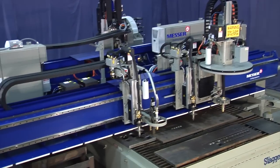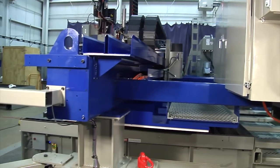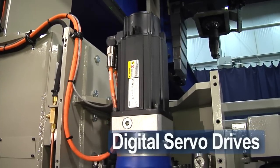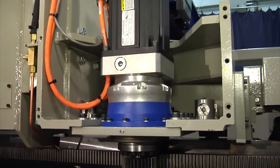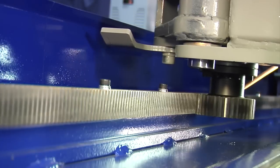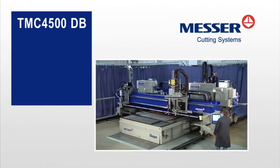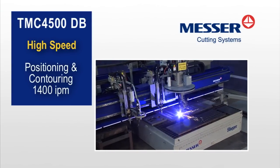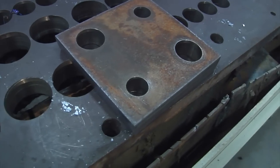The TMC4500DB is a dual heavy-duty box beam constructed gantry cutting machine. This machine uses 6 horsepower digital AC brushless servo drives and precision planetary gearboxes in both the X and Y axes. You get high-speed positioning and contouring up to 1,400 inches per minute for consistent performance.